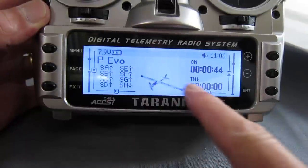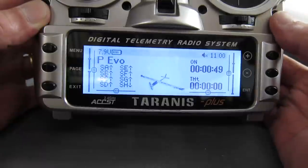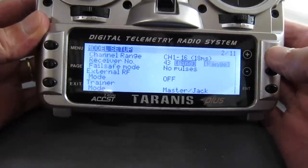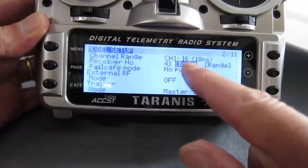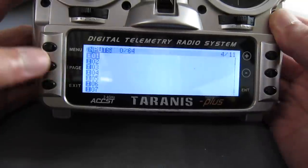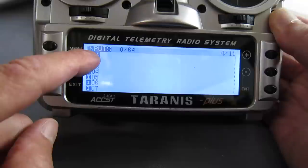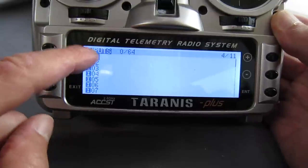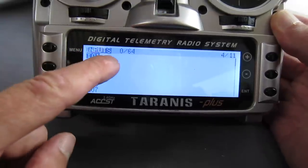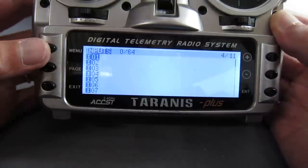I prefer to set up my models totally from scratch. I don't like using the model setup Lua script. First step is to bind your receiver. I've got a video on how to do that. I'll link to that in the description. I don't worry with inputs at all usually. You can set up an input for, say, ailerons and put expo and differential and different sorts of things like that in there if you want to, but you can also do that on the mixer page.